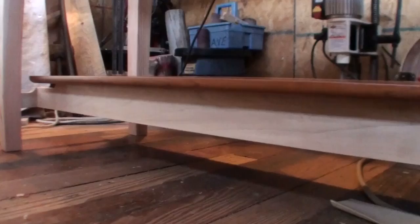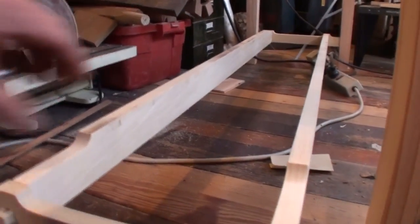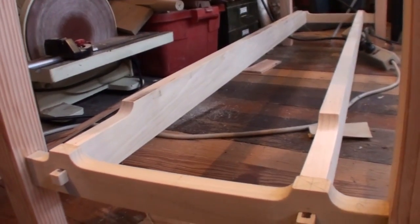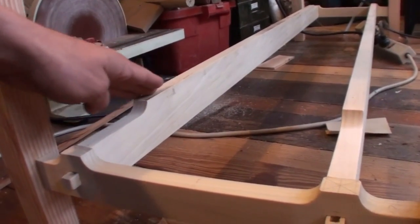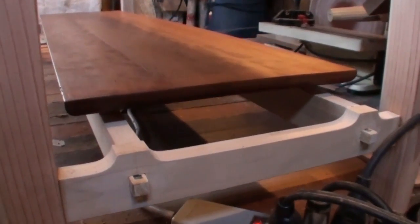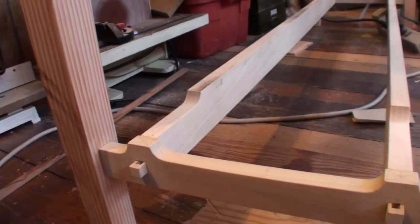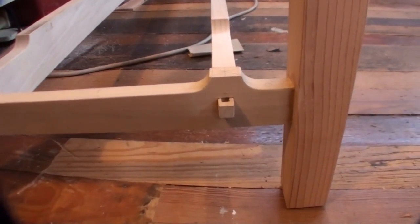The shelf is about 54 inches long, so I didn't want it to sag — I wanted enough thickness in this rail. With that thickness, the shelf ends up coming off and hanging from it, giving a nice floating effect that adds some airiness so the whole piece doesn't look so blocky and solid.